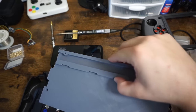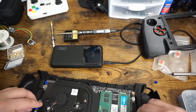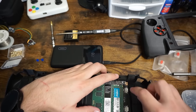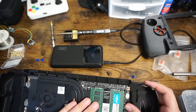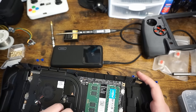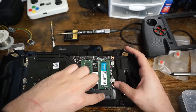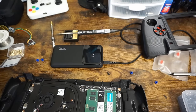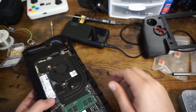I actually had to rewind for a minute and remove the battery sled piece because there's an important part I actually forgot about - I need to be able to turn the device on. There is a switch on the motherboard right here, this tiny little thing that does allow you to turn it on by clicking it. But of course, I don't have access to that from the outside. So I'm going to do something kind of sacrilegious - I'm going to solder wires to either side of that switch. I did find out that through this port down here, you can get a little aftermarket plug-in thing that would let you have access to the power button, which maybe I'll look into for a future revision of the project. But for now I'm going to do something a little horrific, but I will be very careful about it.